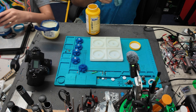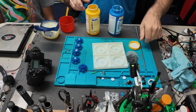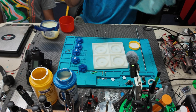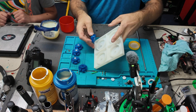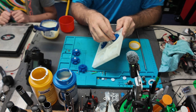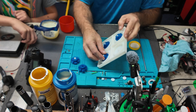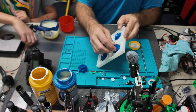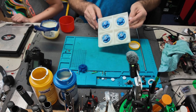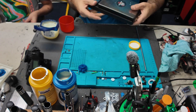Now that we have our mold release in and we've stirred up Parts A and B, we're going to slip our rims back into the mold. I put a little piece of paper in there just to center our wheels a little better so we didn't have to reprint our mold, and it's working out just fine. Do not put mold release on your rims.